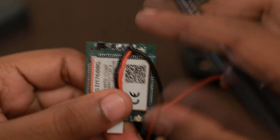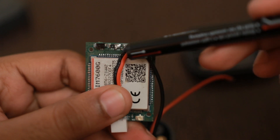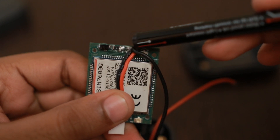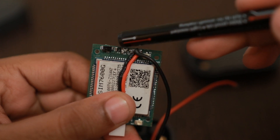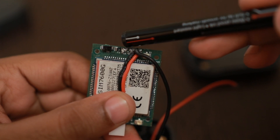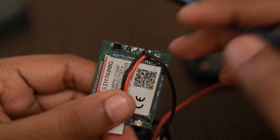Since the board is very congested, we added assembly pads where the power connectors are connected, so we are soldering the power wires directly here. The battery wire connector is soldered here and the power connector is soldered here. There is a PTC fuse added to prevent inrush of current when there is a short circuit, and there is a diode for reverse polarity protection.